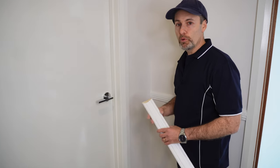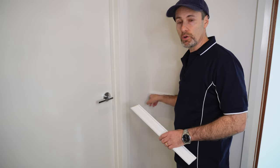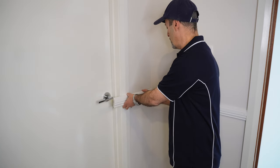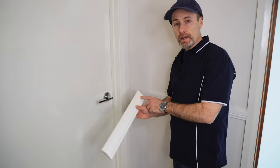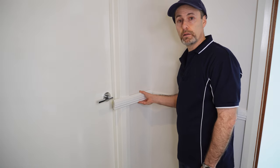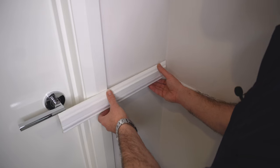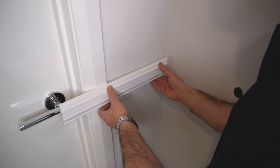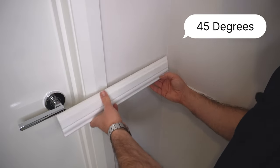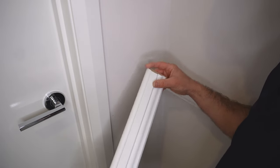To begin with, I've already got one piece that I want to put here that's tucked right into the corner. The other piece I've cut is just an off cut, a bit oversize, and you want to cut a miter joint as if it was going into the corner like a miter. I've just cut it on a miter as if it was actually going in the corner like that — you just do a miter joint. The next step is cutting this out using a coping saw.